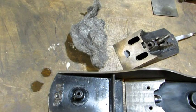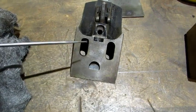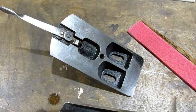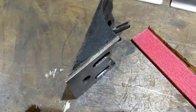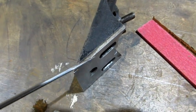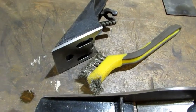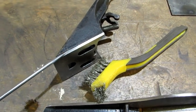There's how the Japanning looks after going over it with the 3-0 steel wool. Next I'm going to use steel wool and a sanding sponge on the bottom and top of the frog — I don't want to remove that Japanning, that's original. In just a minute or two they're looking really good, both the top and the bottom. Attention to detail shows that one little piece of machine surface is still dirty — run the dental pick in the corner, then use the sanding stick and some steel wool to finish cleaning it up. You can also hit it with a soft brush, just don't get too aggressive. It doesn't hurt the Japanning.